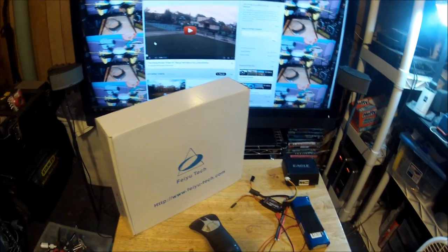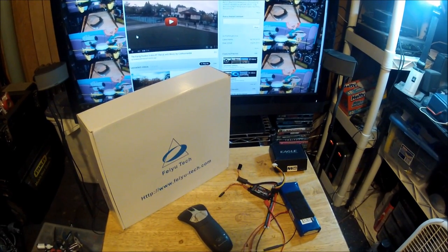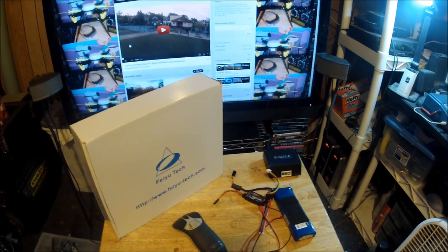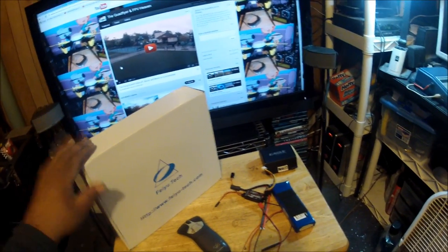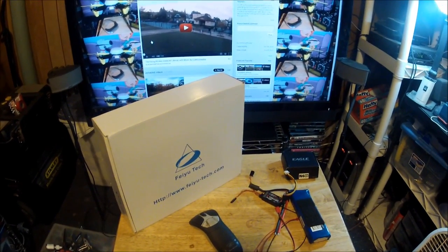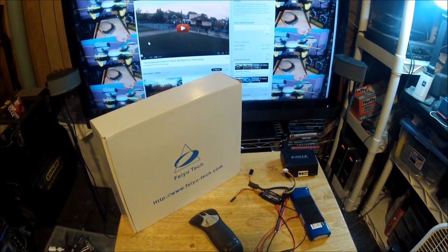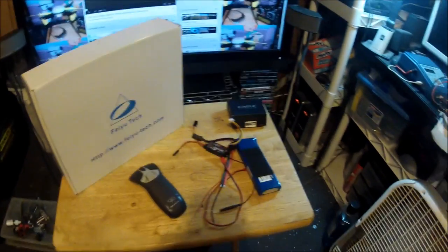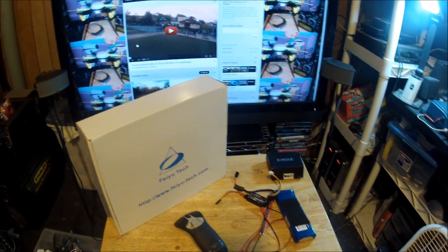I have the GW 330 XX that's pretty much used for those same tasks as well, and I have the DIY graphite X450 quadcopter that I use for line-of-sight flight and night flying since I installed LED lights. So this Y6 over here is going to be able to do all that stuff in one single aircraft. The nice thing is because it comes with six motors, it's a hexacopter, and that's going to give me better payload using three-cell LiPos rather than the four-cell I have to use with my big F550 quadcopter.